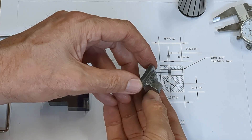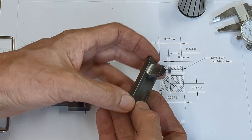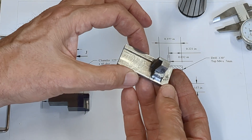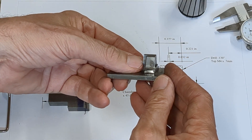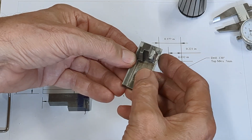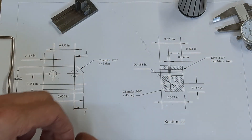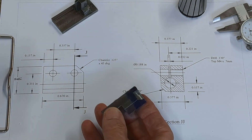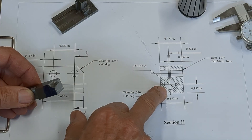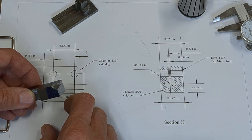After my not-so-expert welding, this is now joined. There doesn't seem to be much distortion, so that's good. I've just tidied it up a bit. I've also put this angle in here — that was easier done once it was mounted on the base. This end is going to come off and in fact this is going to be profiled to provide clearance from the work when in use. What we need to work on now is the tool holder which clamps the tool and sits in this position here. I've got a piece of material left over from the previous job, so we'll start by producing the outside width and thickness, then drilling and reaming the hole for the tool, slitting, and then putting the tapped holes in for the M4 threads.